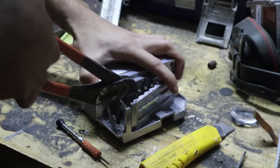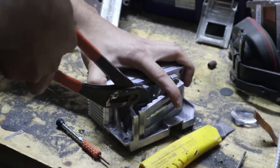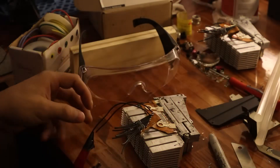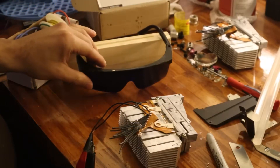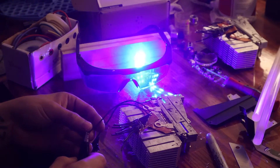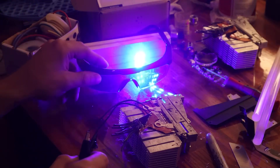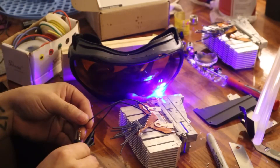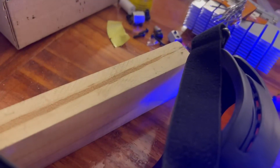One of the reasons why this project took so long is because I couldn't find suitable protective glasses — at least in my country, they were impossible to get. Common glasses let the light pass, and polarized ones do the same. The best laser protection glasses I could get locally were supposedly for blue laser at 445 nanometers, but the laser passed through as if nothing. I brought these glasses from the U.S. — the most expensive part of the project at around $100 — but they have a protection certification and the laser can't penetrate them. These glasses only work for the blue laser of 445 nanometers; if we wanted to work with a green or red laser, these glasses would be the same as not wearing any protection.